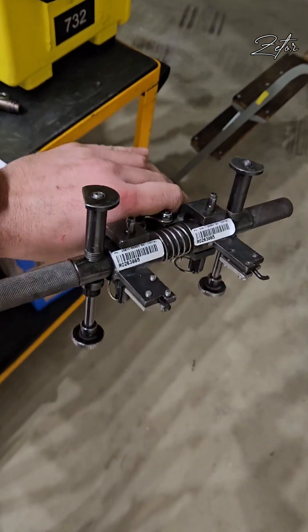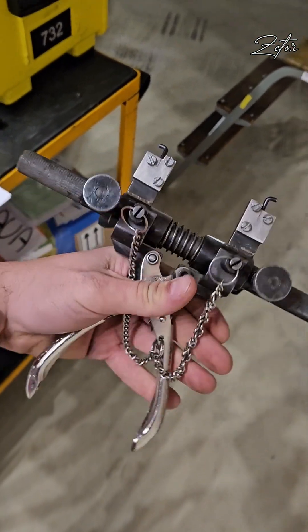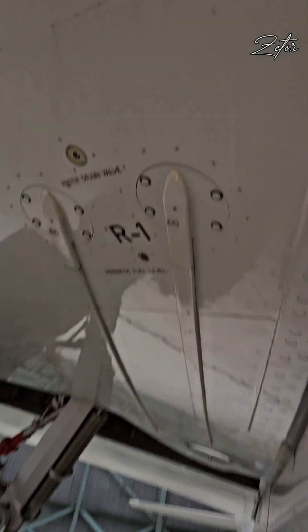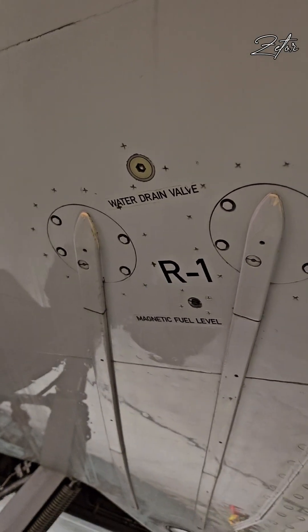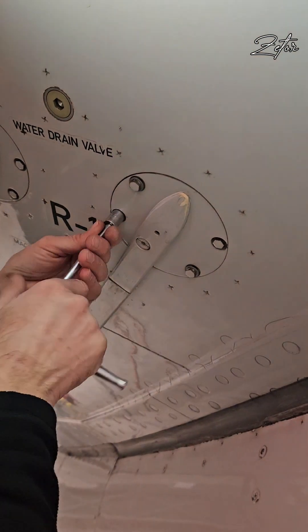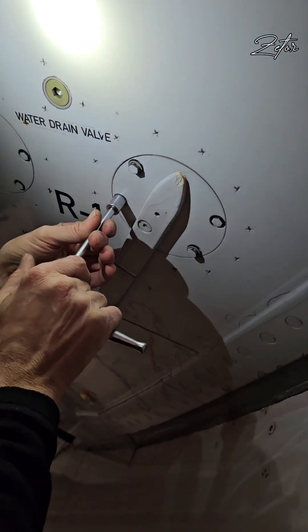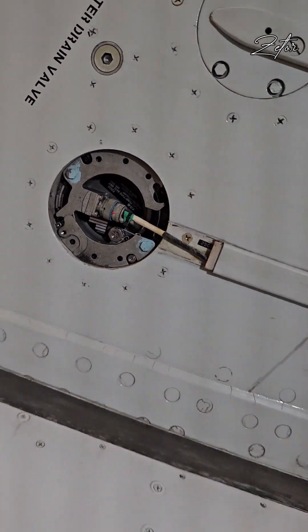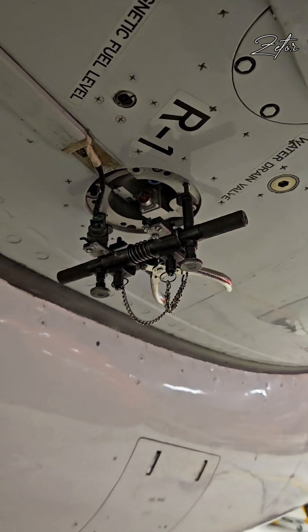For this job we're going to need a special tool called a fuel pump extractor. Then we need to proceed with pulling all the circuit breakers and taking the precautions for working on the system. After that we can remove the cover plate with the fairing, under which we'll find the connector and two remaining screws. We need to disconnect the connector and remove both remaining screws.